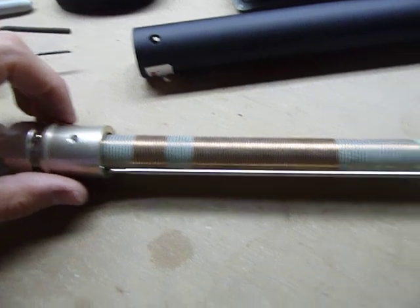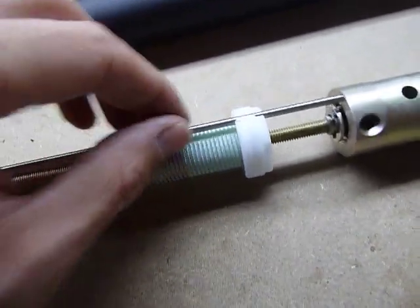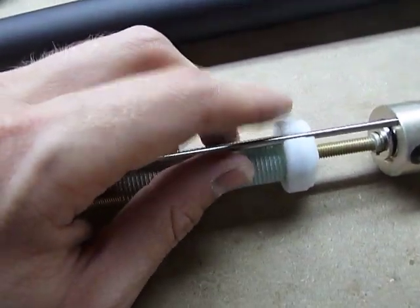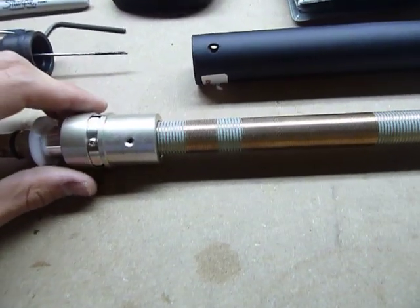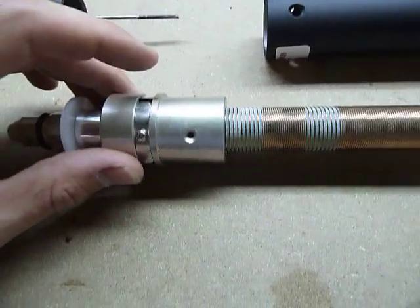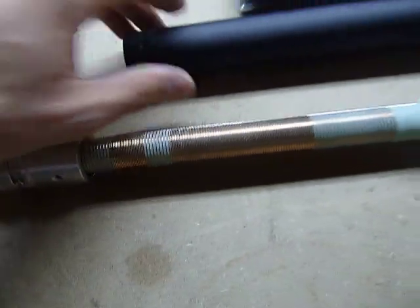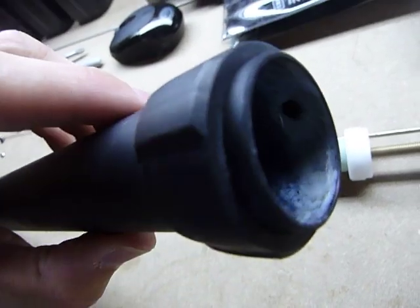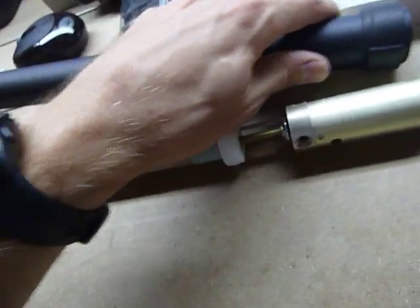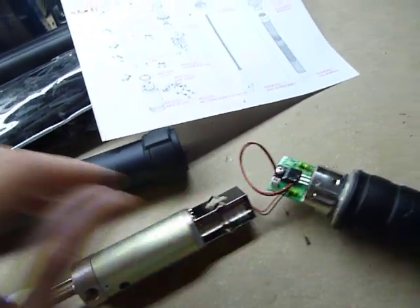What you're looking for in here is any damaged parts. These plastic followers that go along the metal tube to keep everything straight — sometimes these crack, though I've heard you can still use the antenna even if they're damaged. You're looking for corrosion mostly, and any loose contacts. Sometimes the springs holding the ball bearings down get a little loose, and you can unscrew the tabs and bend the tangs down to press harder on those bearings. I noticed some corrosion down at the bottom where it meets the base of the antenna — go in and clean that out with some Scotch-Brite. Don't put any anti-seize compound on there because that is an RF connection and you need a good electrical connection.